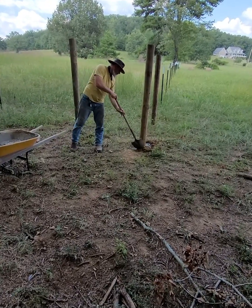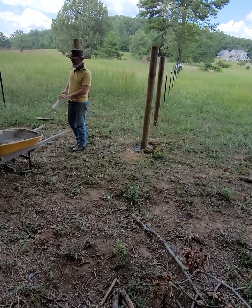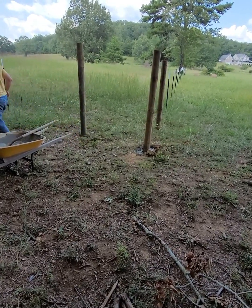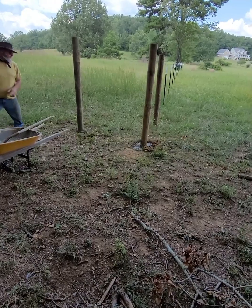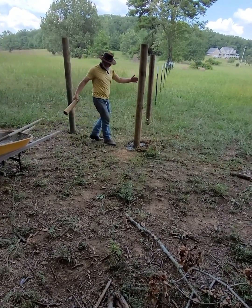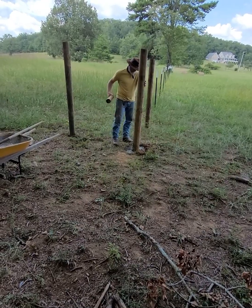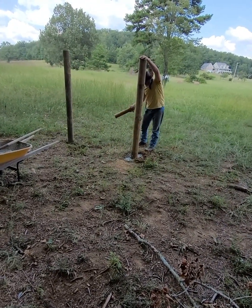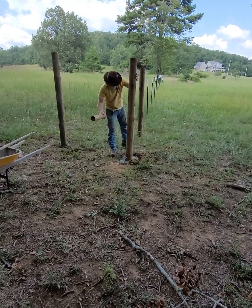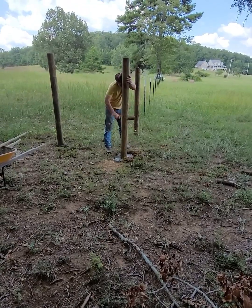You can see there how wet that concrete is. Again, if I was doing something that was going to be supporting a structure that was going to have any weight on it, if it was going to be a footing or even a driveway or a sidewalk, I would have poured that a lot drier. But knowing that this was just going to be filling a hole to hold my post, I was more concerned about having the concrete flow and get down in all those cracks and crevices and not leave any gaps.